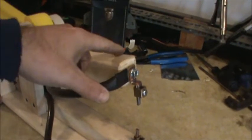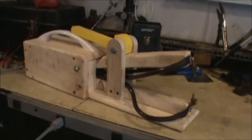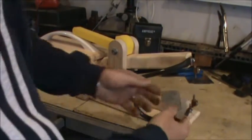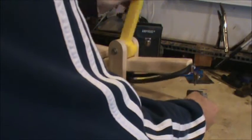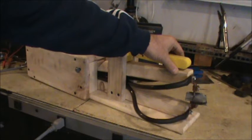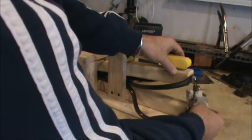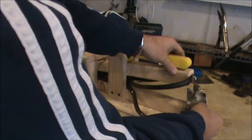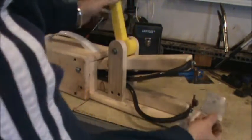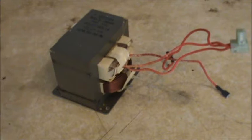Here's a quick look at how it works. We're all plugged in, the power switch is on, and I have two pieces of sheet metal. We drop it in here — you can see the cam is used to hold it in place — then you hit the power switch and once it heats up, it'll weld your metal. It works a little bit better if you adjust the metal in there; it helps it act more as a resistor and gain heat. You can see it's spot welded together.